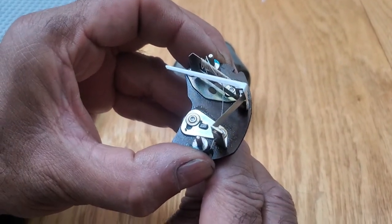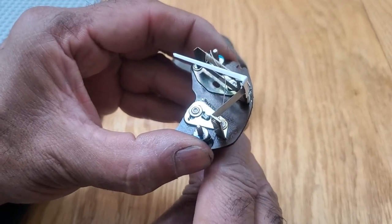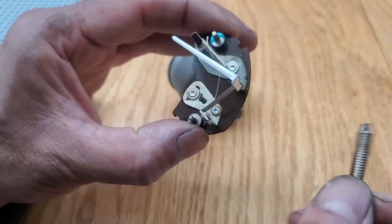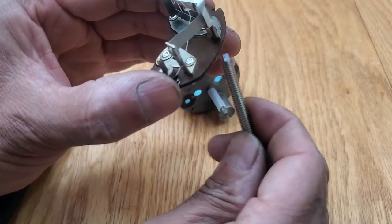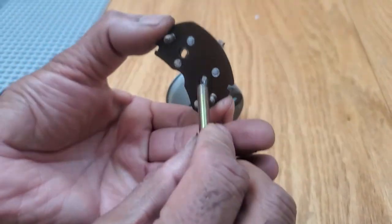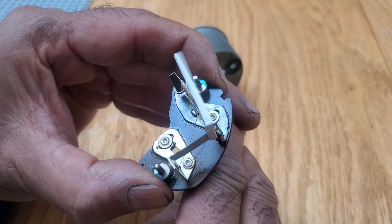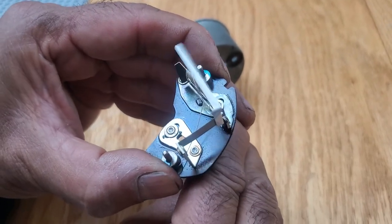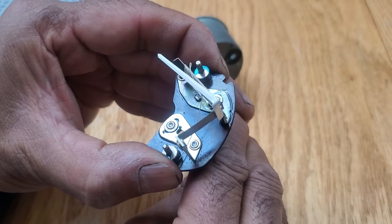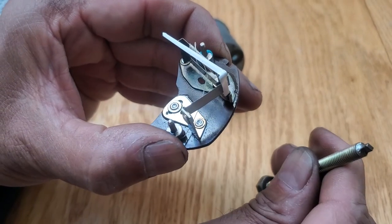For the hot temperature end, you put it at 7-point-something volts — whatever voltage I specified — and adjust accordingly. As I mentioned, both adjusters are connected to each other, so you may have to tweak both of them again and again to get it ballpark. As you can see, moving this is how you calibrate your gauge. Thanks to my son for holding the phone so I can show you better.